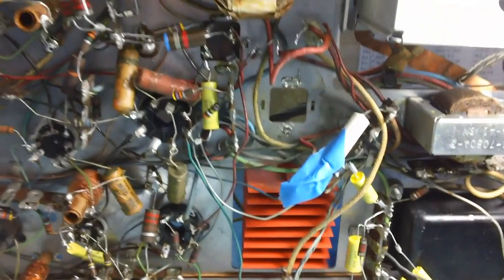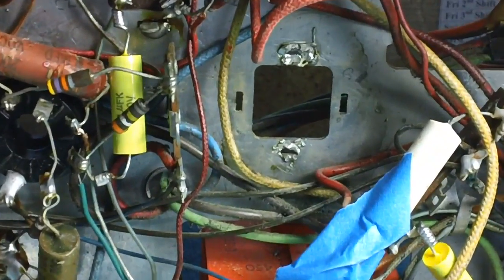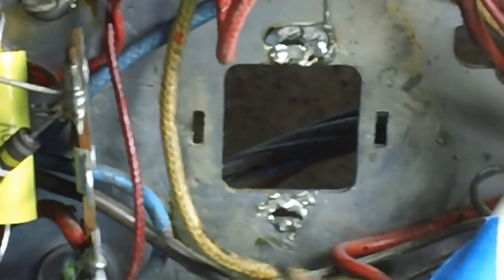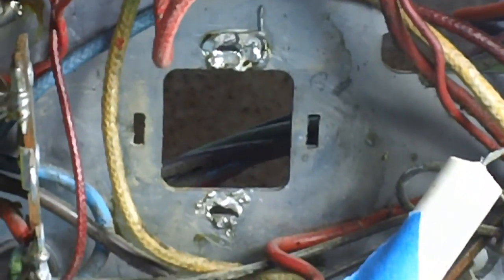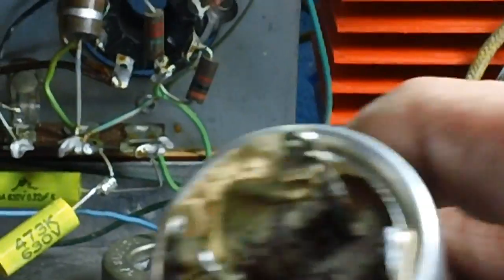I think what I'm going to do is shed a little more light on the subject. I still have a little bit of solder I want to extract from around those holes that anchored it in. What I did was heated it and then just pulled up on each side of the can on top of the chassis until the tabs slipped right out. A lot of the solder was removed. Let's go ahead and open this baby up. Look at all that acid that built up in there - all that dried stuff, I guess it's boric acid. Looks like a mud wasp nest to me.